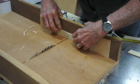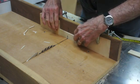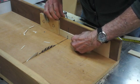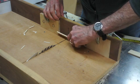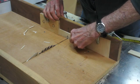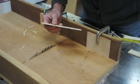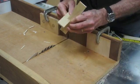To make the divider parts on the table saw I use a setup with two stop blocks. The two stop blocks together allow me to make a cut to the right and then slide it over slightly and make a cut to the left. Then I can flip the piece around and I'll make the same cuts exactly the same way left and right, and that gives me grooves that should be perfectly sized to fit the adjoining pieces.